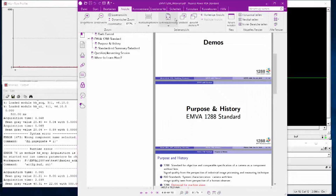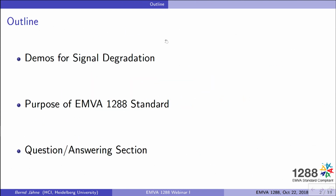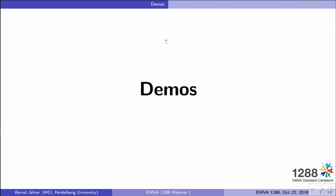what we have seen here is, the demos clearly told you, we have 3 types of degradation. One is simply that each time you measure a little bit different values, what is called temporal noise, and it is obviously very critical how much temporal noise I do have in relation to the signal. That is one, obviously, quality criterion we have to measure in detail. And this as a function of different irradiation levels in our camera system.